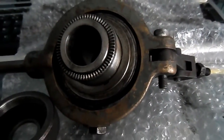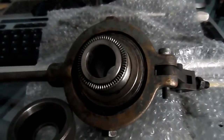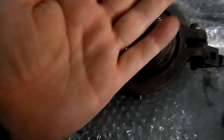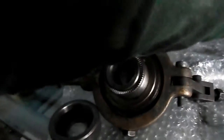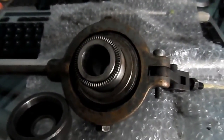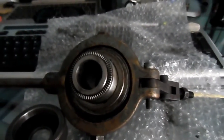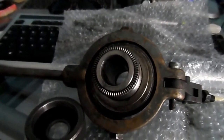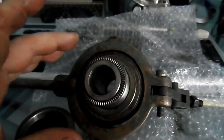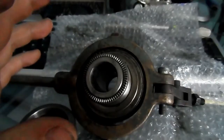I've got a small vertical milling attachment for the lathe. Just for any real machinists watching — I'm talking about a table that's not much larger than my hand, and I've got small hands. You can't achieve large projects or large components on an ML7 — it's a small lathe, and the milling is going to be even more restricted. But if you want to cut a T-slot in a bit of metal, or possibly a keyway, then this collet chuck in combination with the milling table gives you that functionality with your lathe.